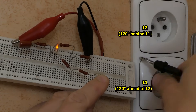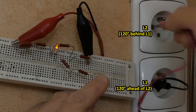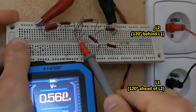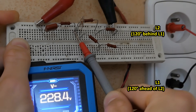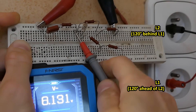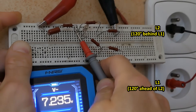Now let's plug it in the other way — the lamp is lit, and it stays lit even with just one of the phases. In the direction where it lights up, the center point has against neutral basically the full phase-to-neutral voltage. In the direction where it doesn't light up, the center point against neutral is just 7 volts — definitely not enough to light the lamp.